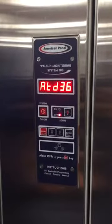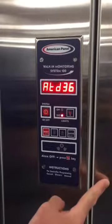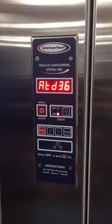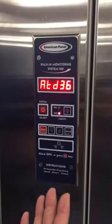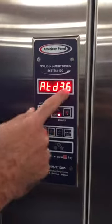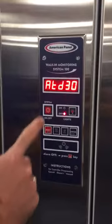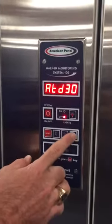Alarm time delay — to avoid false alarms from temperature conditions where the probe is next to the door in a high-traffic area, with people going in and out. We don't want that in-and-out traffic to be read as an actual failure of the compartment or refrigeration alarm condition. So this current configuration will wait 30 minutes before it will actually alarm and alert the user there's a temperature condition they need to look into.